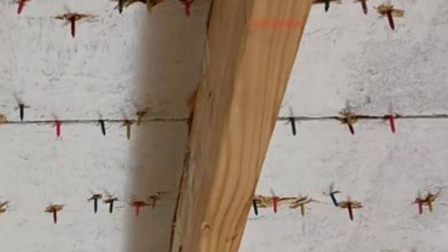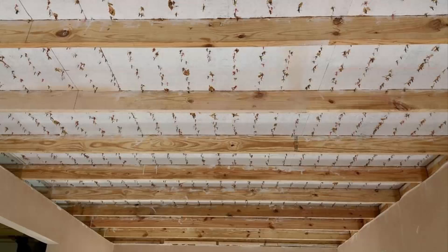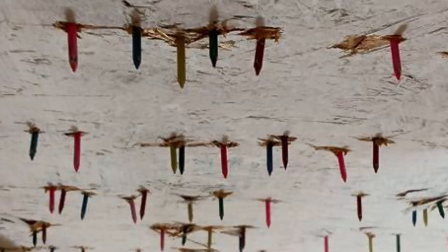Composition shingle nail lines repeat up the slope of a roof approximately every six inches. This means that there would be a horizontal row of nails every six inches all the way from the bottom to the top of the roof plane. Once the old roof has been torn off, the new shingles would be installed beginning at the eave of the roof as were the shingles of the original roof.